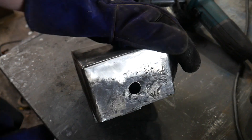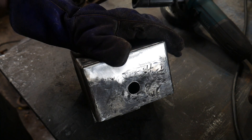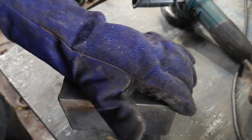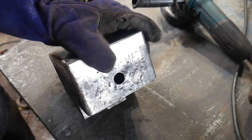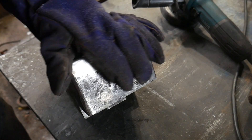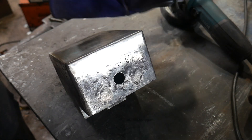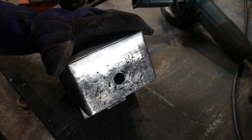Very pleased with that — it's come out quite lovely. I'm hoping it's not going to budge. Hard facing rods are normally used for high abrasion rather than high impact, but we'll see what happens. This part of the anvil doesn't work that hard anyway — it's where all the kiss spots go. We'll see if it pops out or cracks; I think it's going to be pretty good.